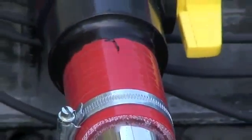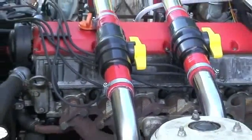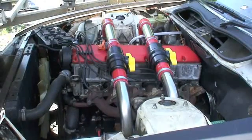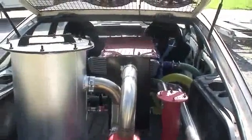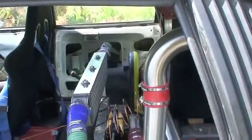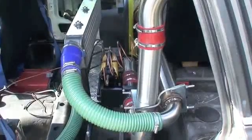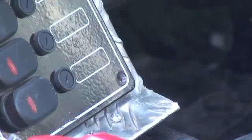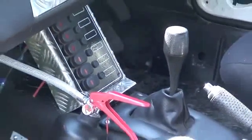At the cool end of the system we used silicon hose and stainless steel tube. We have also fitted 2 valves so that we can turn off the gas going to the carburetors when we are priming the system. You can see the cooler fitted there — we later fitted 2 twelve-volt fans to that to aid in the cooling process. We also have full control over the electrics, including the intake fan and pressure fan for priming the system.